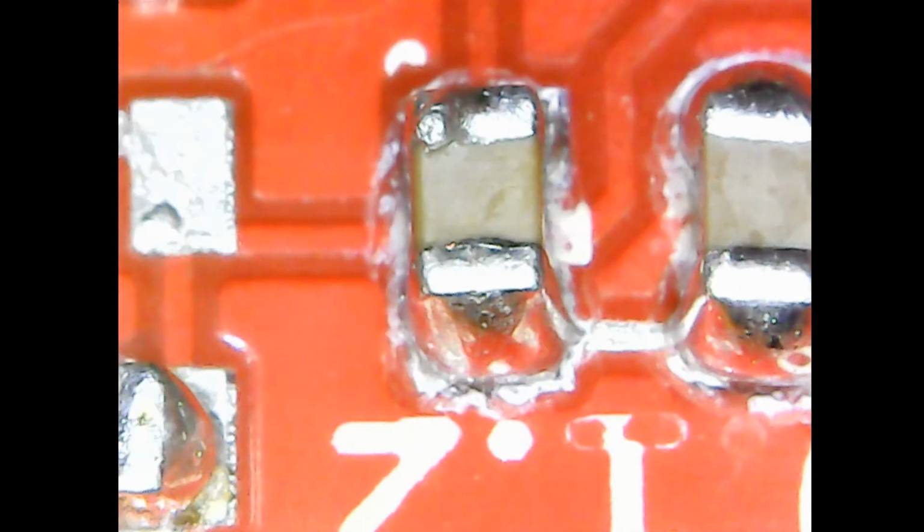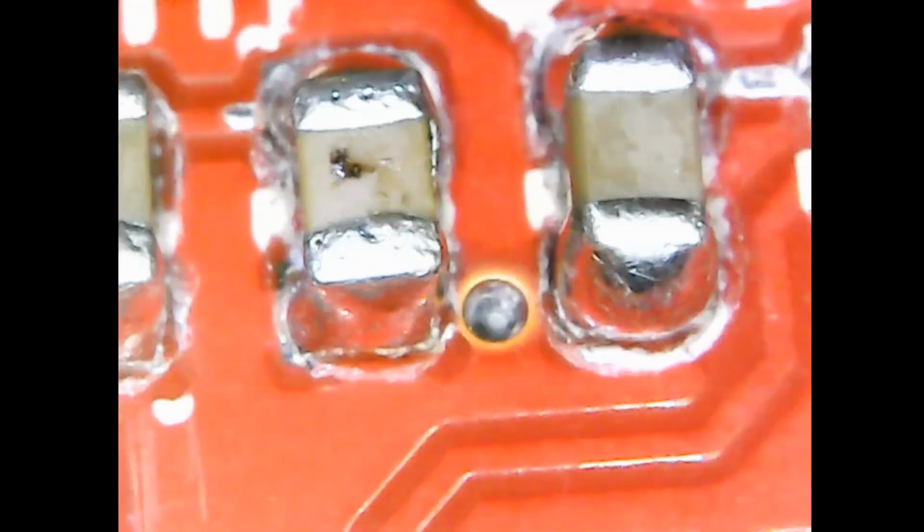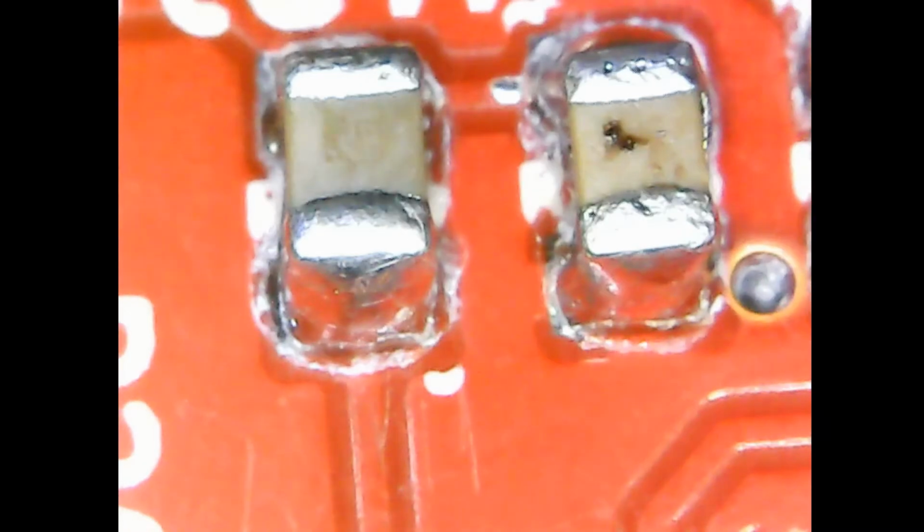But the problem is, it's nearly impossible to hand deliver in a syringe. It's just so high solder and low flux that it's very hard to flow through small nozzles. And if you are able to get through a small nozzle with the massive amount of pressure needed, it doesn't stick because of the low flux count.